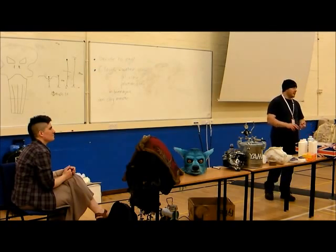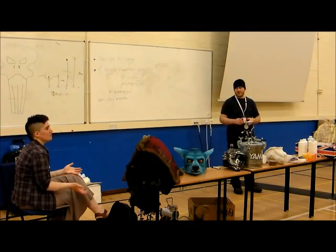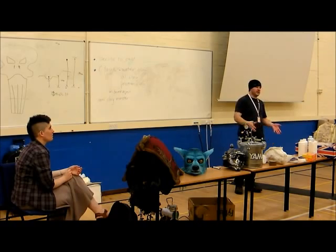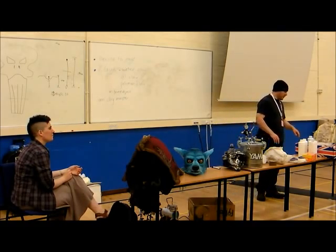There's waxes, there's all sorts of stuff. A lot of materials don't need to be released. For example, you can put silicone straight onto chavant, it's fine, it doesn't need a release agent. And you can put plastic straight into silicone. Silicone self-releases, except for when you cast silicone into it, but we won't go there because that's very complicated.